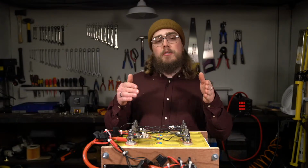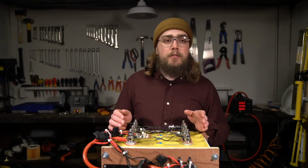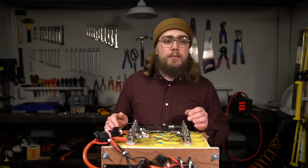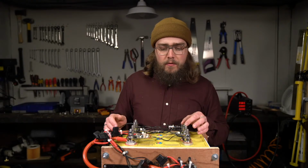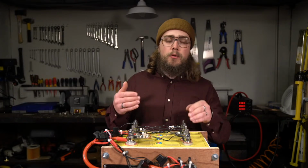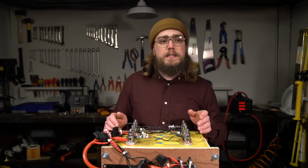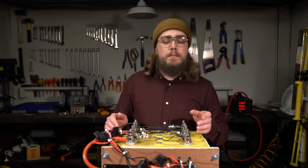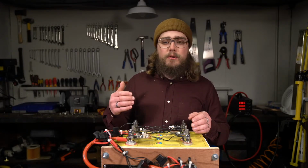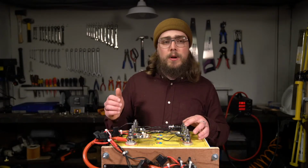So you can go from 100% state of charge all the way down to 0% state of charge if you want to, and the battery has no memory, so you can then recharge it back to 100% state of charge, and it would work perfectly the same as it did before. Obviously if you overcharge it, so if you charge it more than a total of 14.6 volts, or for each individual cell 3.65 volts, then you can damage it. And if you go below probably about 2.5 volts per cell, realistically you probably want to keep it at around 3 volts per cell, so 12 volts total.